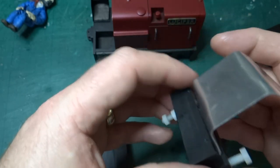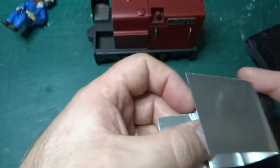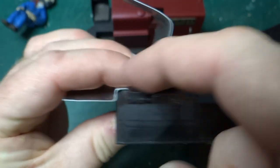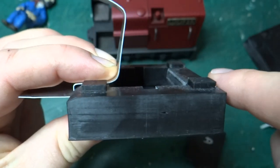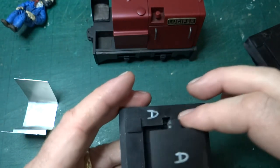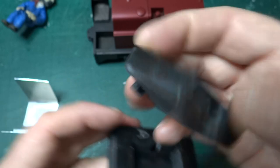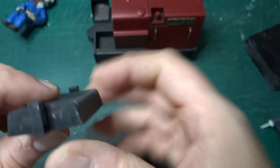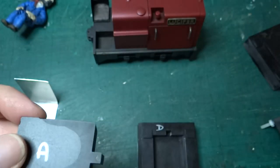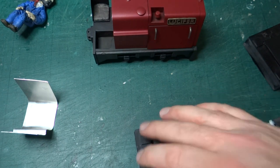That forms the second fold, and then you form the complicated top shape by putting that in here. And as I say, that chamfered edge essentially allows you to position it correctly, and the metal then goes straight across here when before it's bent, and then this block essentially engages in the top and pushes down to form the right shape. A hydraulic press would probably be the best thing to do that, do it nice and smoothly. I don't have one, so I've just been using the drill press on my lathe to do that, and it works. And what you get, as I say, is this shape.